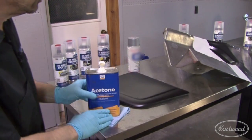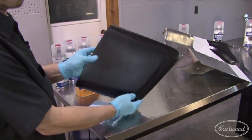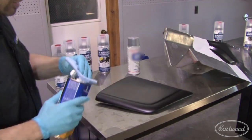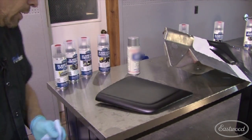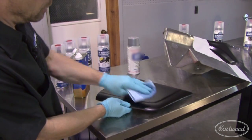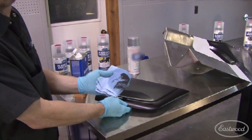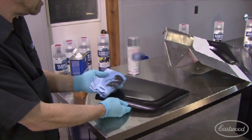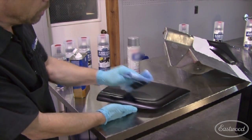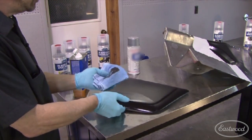Take a closer look — we're going to do a little test here. This is a piece of fiberglass painted with a satin finish. It's got that half gloss luster. A little bit of acetone, which is about the same strength as lacquer thinner. Look what happens — that's the paint coming off of there. So obviously there are issues. It's not going to be as strong or as resistant as your catalyzed paints.